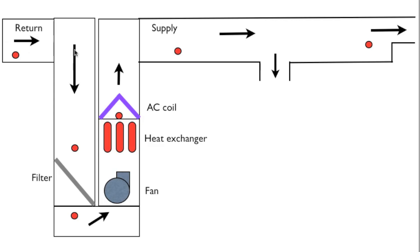There's a pressure drop in this return air due to friction of the walls of the ductwork and the corners that are made. Of course, down there we've got a filter also. The pressures we read here are all going to be negative pressures. Then on the outlet of the fan, it's going to go positive — pushing air through the supply and out different runs. In the return, it's all going to be negative pressure because the blower is sucking on the return.